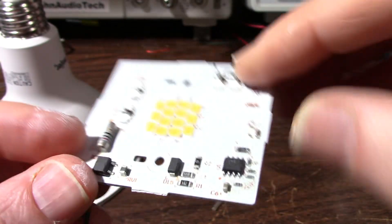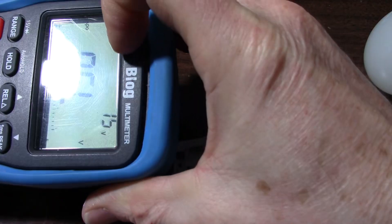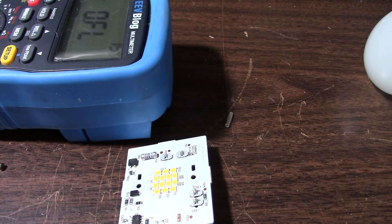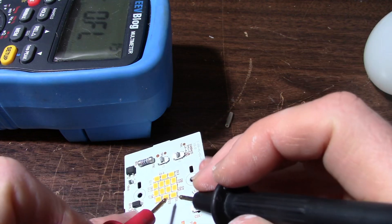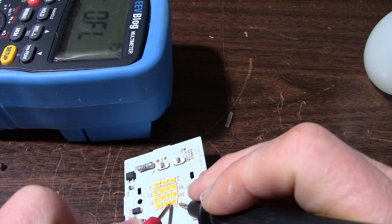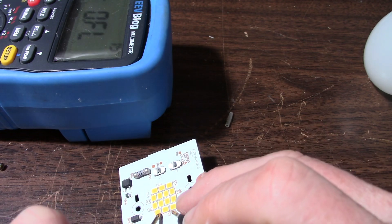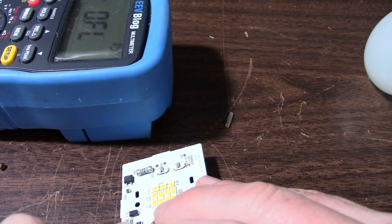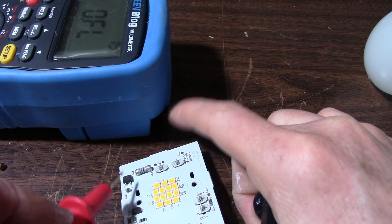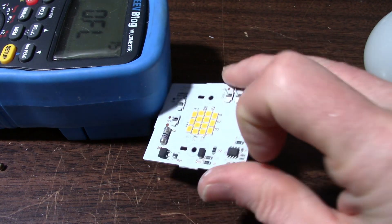Sometimes you see little dark spots in the LEDs if they've been driven hard, or even cracks in the surface. There's no discoloration of components or anything. But that really means nothing, so I'm going to put the meter on it and see. Using this meter — it has a 15-volt diode mode — I should get some sort of result out of these LEDs. I went through all the chips and they all light up just fine. I checked some other components on the board and I don't see any problem. It could be something with the driver chip.